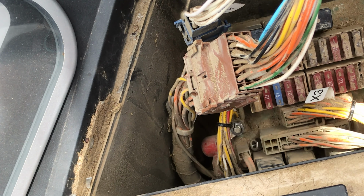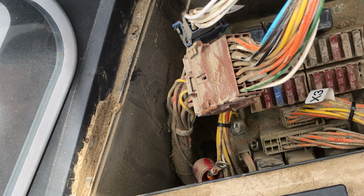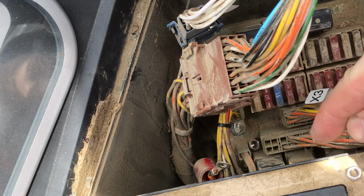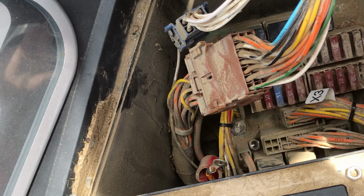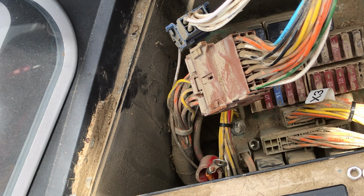I worked on this for a couple of hours, but it turned out that the wiring harness was just too damaged and was buried underneath the boom. Everything I tried showed that the positive and negative terminals were shorted together, which is not too surprising considering the fact that I can see the wiring harness got pretty melted.